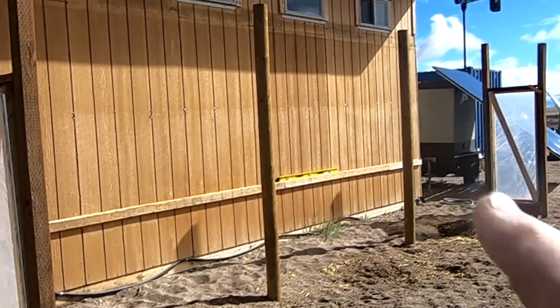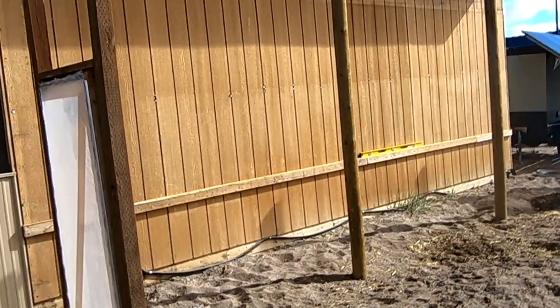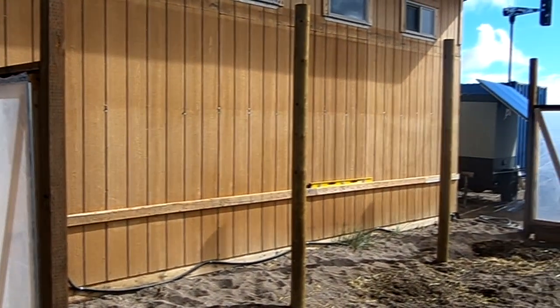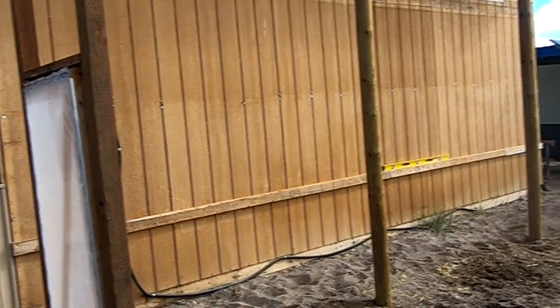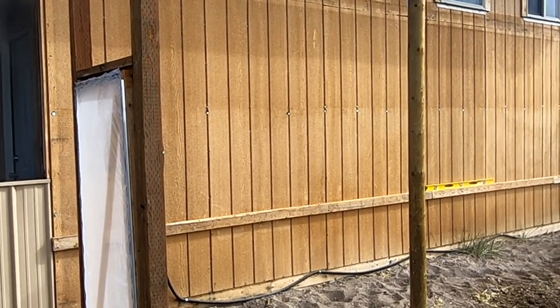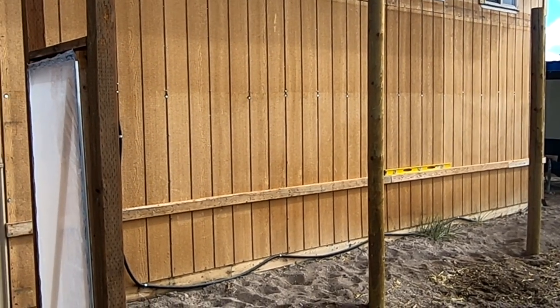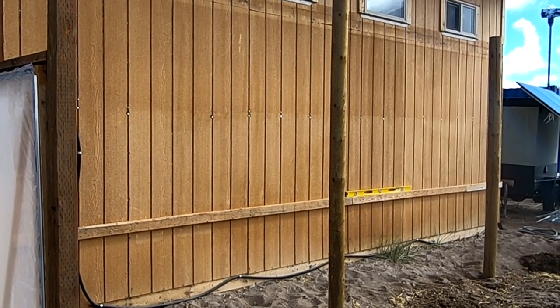And the greenhouse is down except for the doors. I gotta get the jack out and pull these posts. But I had Wormsky out here yesterday and we finished pulling this down. He did most of the work. But then I asked him to put those 2x4s there, make them nice and straight, because I want to use this front of the house as a jig to make certain building materials for the house. So the front of the house is 24 feet. I can build a jig right on the front of this house that will help me assemble I-joists. So I'm going to try that because there's hardly any cost involved in doing it. And so we'll see how it goes. We'll make a test piece and see how it goes.